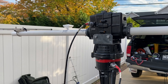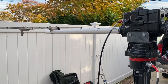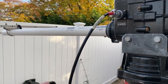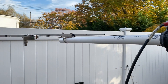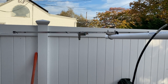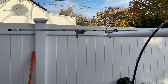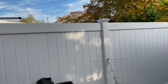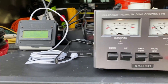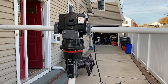Hello everybody, just a quick video on the proper way to install your G5500 rotator along with your antenna. This connector here on the elevation rotator should face north, and then your antenna should be installed parallel to the ground — not facing the ground or facing up. That's when you're set at zero and zero on your control box, with the antenna parallel to the ground facing true north.